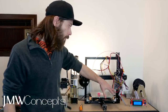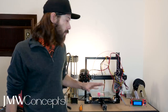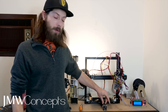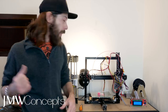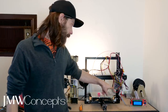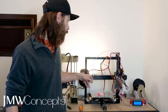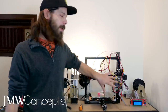Now the features on this — being a new board, there are some pretty cool features. The pause option works flawlessly; I've tested that a few times already. I really like the wheel bearings on it. It's really, really quiet to print, especially compared to your linears like on the Anet A8. The PSU and PCB fans are really cool. Not mounted at the moment because I'm going to add a couple more fans, one being a part cooling fan. Once I've got them all done, the board will be closed up.